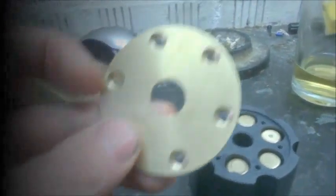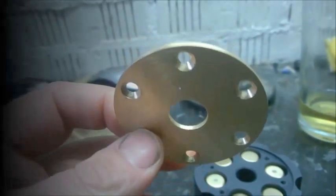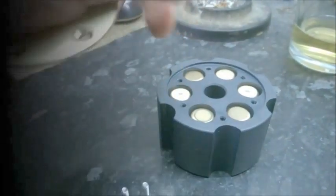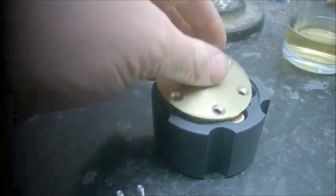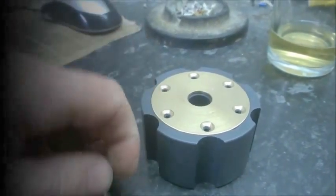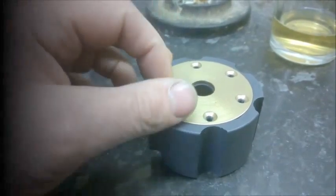Then I had a bit of a plate, countersunk. This was turned, but you could easily do it with a bit of sheet steel — it can all be done on the mill. You can do it by clamping, interpolating, and drilling. This could be out of a piece of flat plate. Pop it on so it's nice and just drop the screws in. And there you go.